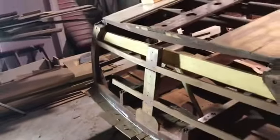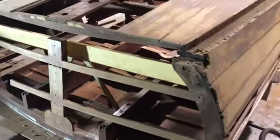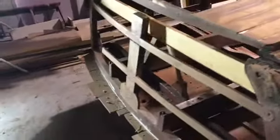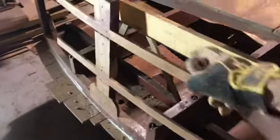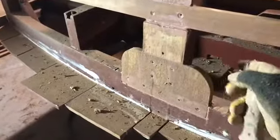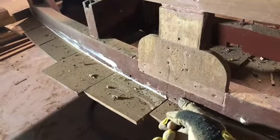Up on the top — this is where it gets a bit serious. We've got a full new transom to build. It had rotted away in the bottom corners and the top corners, and you can see this localized rot here, so these planks need to be replaced on both sides. A whole new transom assembly needs to be made and installed. We've already done a bit of this when the boat was upside down — we put new battens in. This piece here is interesting — originally it's just fixed in with screws from the underside, which just flog out over time.